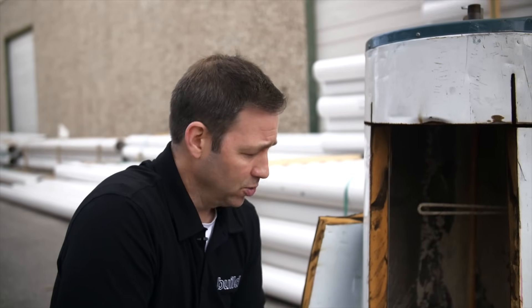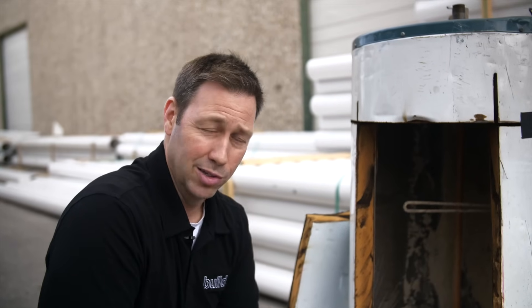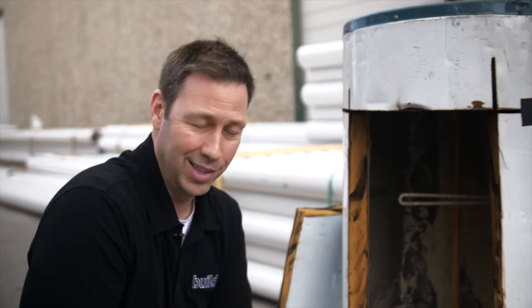Here are the takeaways: replace your anode rod, flush your tank, and look at those EF ratings — get one with a higher EF rating. Most standard tanks are gonna be somewhere between 0.5 and maybe as much as 0.7, and the higher the rating the better. I'm a big fan of the really high-efficiency units and stay tuned for future videos on those. It's really interesting to cut these open and see how much scale builds up. I'd be willing to bet 99% of water heaters out in the world never get maintained. So if you're watching this — maintain your unit, drain it at least once a year, and replace that anode rod. You're gonna get way more life than the standard 15 years. Thanks guys, we'll see you next time.